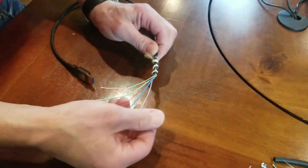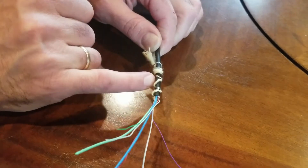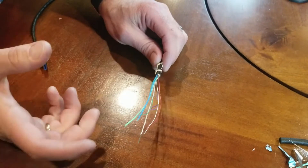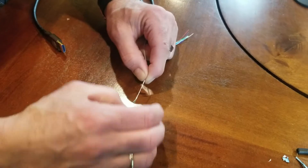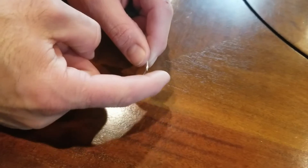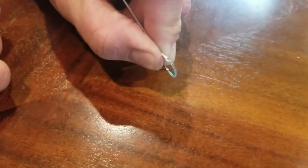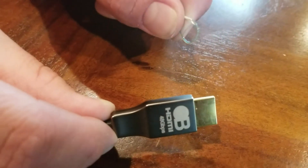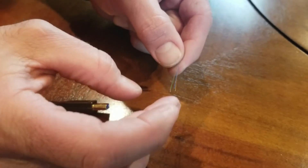This is a completely different cable. One of the first things you notice is that there just aren't as many conductors. Back here, this braid is actually Kevlar, so they use that to ensure strength and make sure there's no damage. And here's the biggest part of Bullet Train cables — the fiber inside that they're using to carry the stream. There are actually four individual fiber streams, and in the connector, it's doing the copper-to-fiber conversion. At the other end, it converts back.